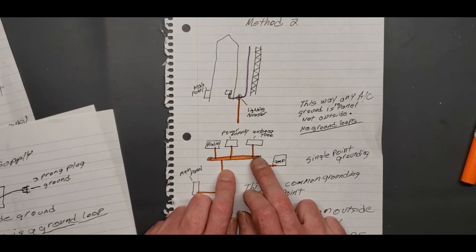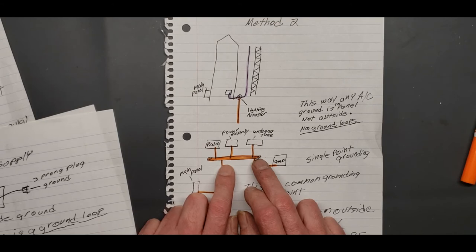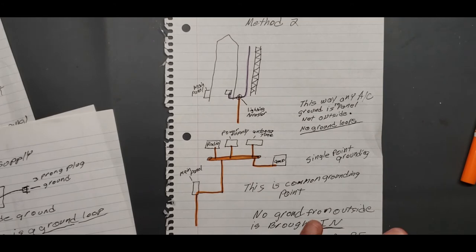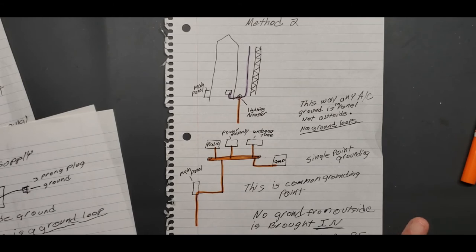You're not really doing it for grounding purposes. Usually when you plug most of your accessories in, the case is going to be grounded anyway. And you're basically just taking the house ground, not actually grounding to, say, a ground rod. What you're doing is taking the RF. Now, a lot of techs won't have this problem much because they're not running a lot of power. HF, the HF guys are running the power, and that's where you get the RF. If you're talking on VHF on a 100-watt radio, you're not getting much RF, if any. Very little, unless you've got crappy coax.